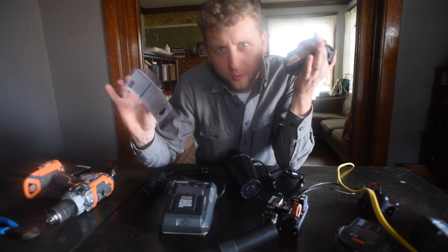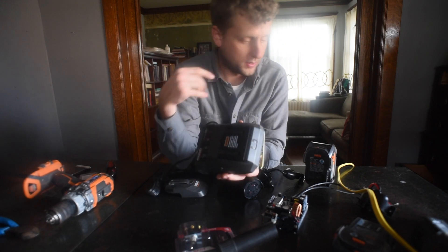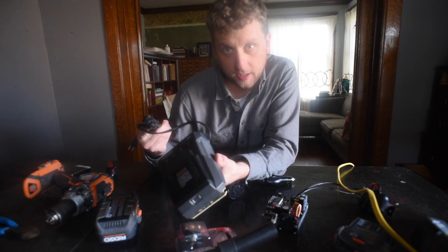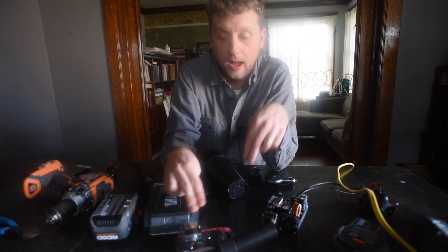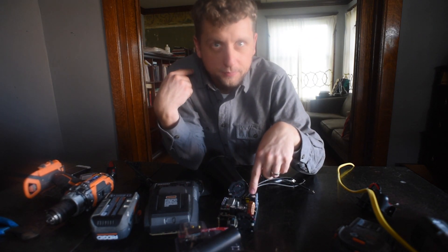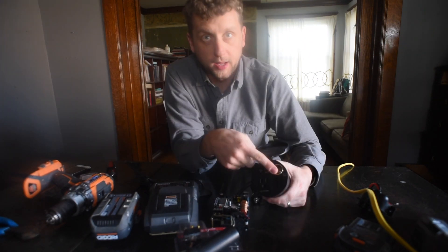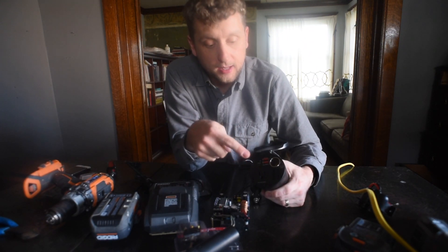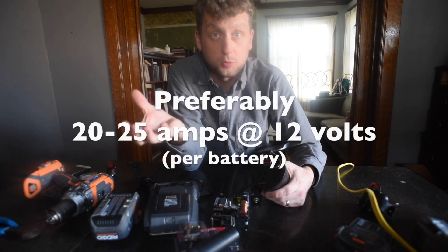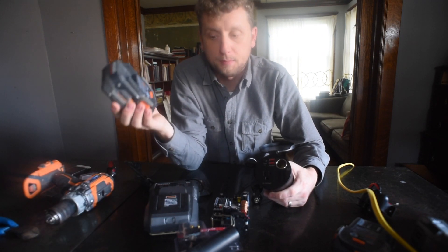Here's the thought: we take our charger and add a switch — I'm not sure what kind of switch. That switch is connected to the positive and negative terminals, so when I slide a battery in I'm able to continue using this charger like it's meant to, or I flick the switch and it goes out to what's called a buck converter. I'm stepping down to 12 volts, and now I have 12 volts that I can plug a 12-volt application into, charge USB things, or use an inverter and have about 150 watts of usable power for my computer or similar devices.